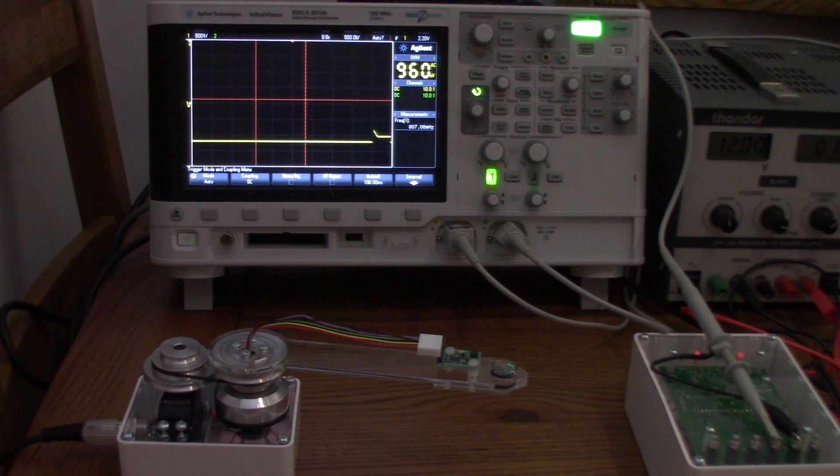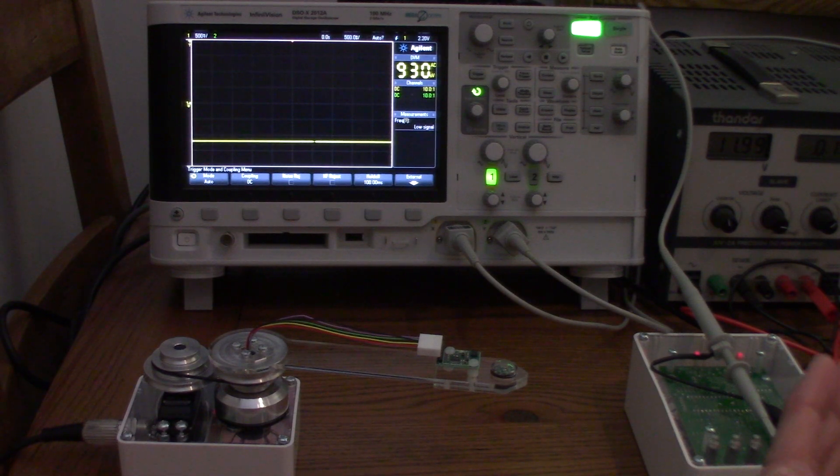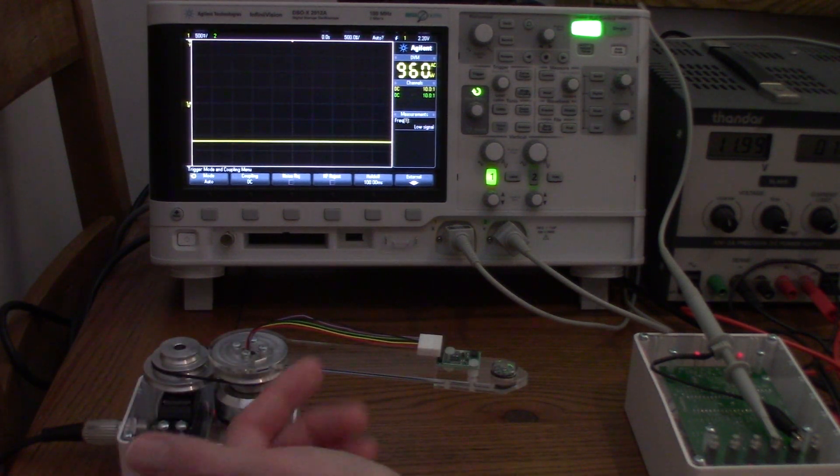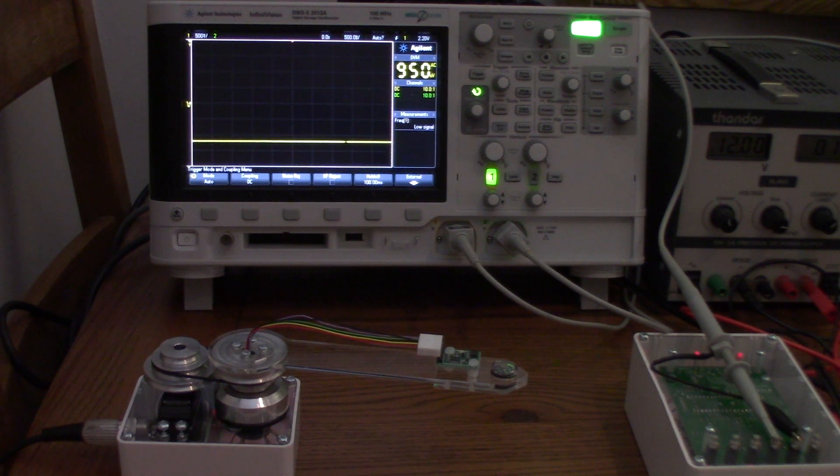In the next video we are going to use option 6 to rotate the compass clockwise and characterize our servo by plotting offset versus frequency to determine how linear the device is. We know it's not linear, but we want to know if there's any linear portion in the range. We'll also look at this for different pulley systems — one-to-one, two-to-one, and one-to-two ratios — to see the correlation between them. That next video will be titled 'Transfer Characteristics for the Servo.'